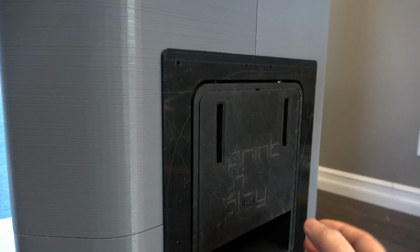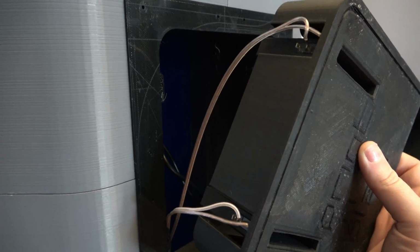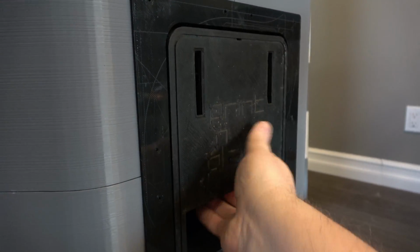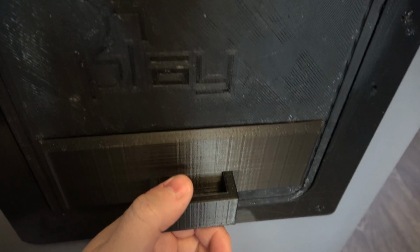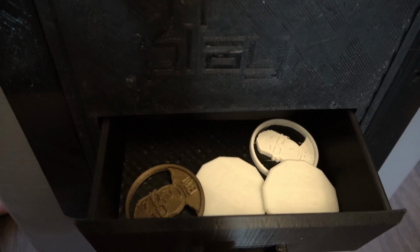The design is pretty simple. A micro switch on top with a bent actuator. It provides just enough friction that the coin presses the switch on the way in and triggers insert coin in MAME. Of course, there's also an insert coin button for each player on the main controller, just in case the novelty wears off. The inserted coins fall into a small drawer that's underneath the coin slots, allowing me to collect maker coins without ever having to leave my table.